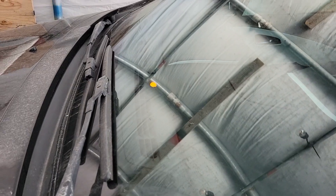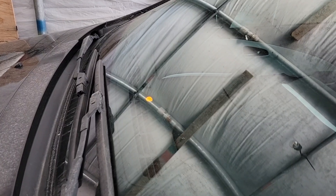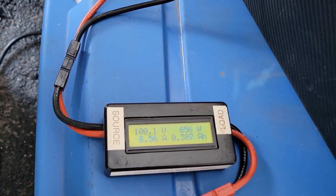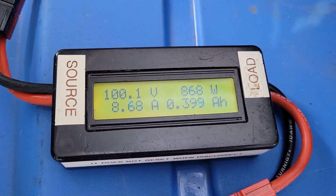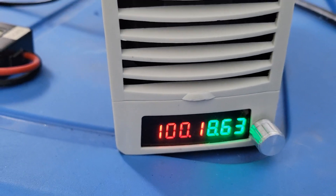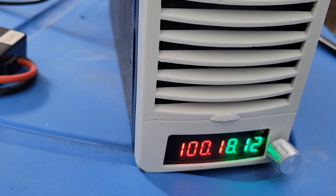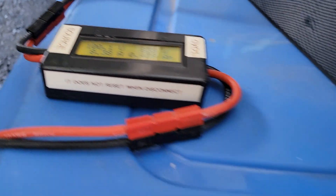Yellow light here, the relay clicking — it will begin at 100 volt DC. We'll see: 600, 700, 800 watts. It's not 900 watts, it's 800, so a little less power. Still about 8 amps — it won't compensate above 8.5 amps at 100 volt, but it's still charging.